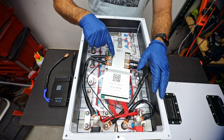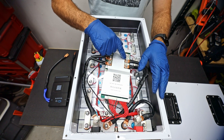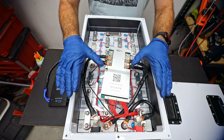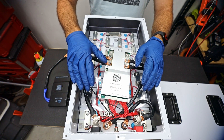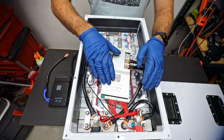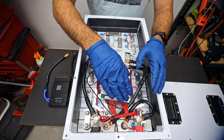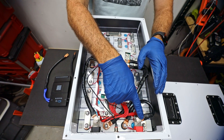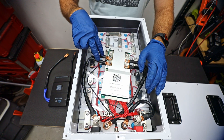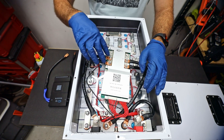We also have an on/off switch here which allows us to connect to this and turns the whole battery off if we're not using it. These are the giant wires going into the battery management system. You'll notice this one says P minus — that's post negative — and on this side it says B minus, which is battery negative. The only reason we have the battery management system hooked up to the negative side is because we only need to break one side of the connection to turn things on and off. The big positive wire goes straight to the post, and this pigtail helps split up the heat coming off of the battery management system and the post.